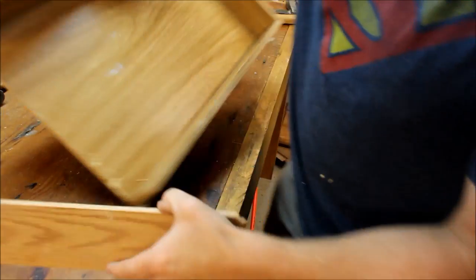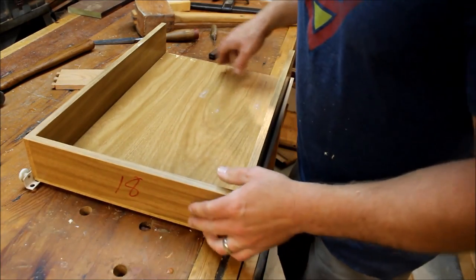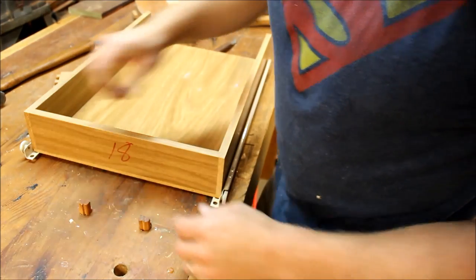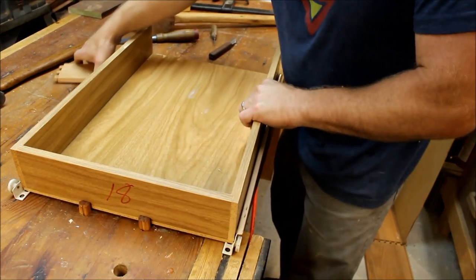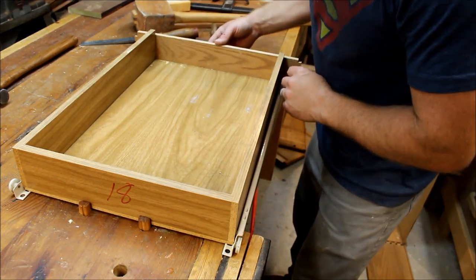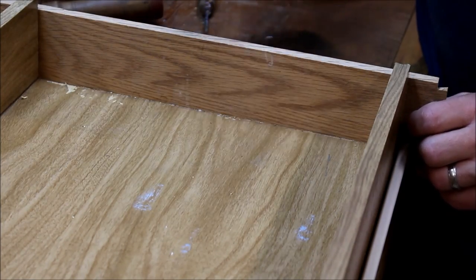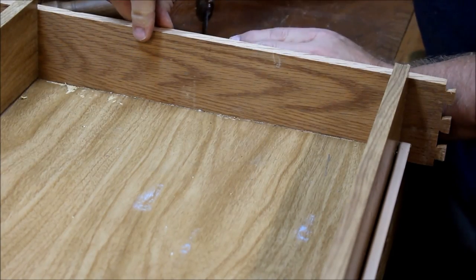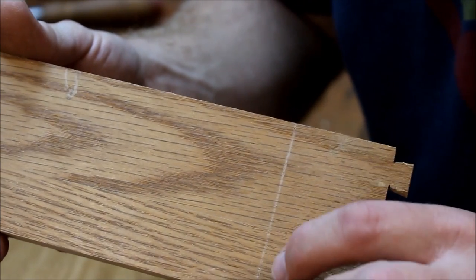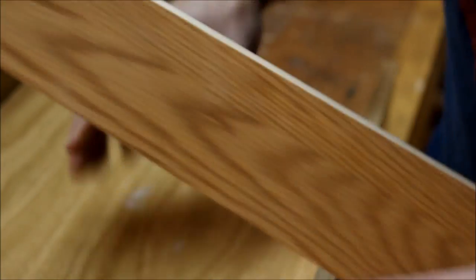To ensure I have a really tight fit, I've been putting it in place and holding it there. I need something for it to rest against, so I'm using a bench dog. Now that drawer's not going to go anywhere. I can apply some pressure back towards the drawer and mark with my marking knife exactly where I want it cut. This is much more accurate than if you tried to measure it. I have a nice scribed line and I can stay to the outside of that when I cut it on the bandsaw — that gives me a nice accurate cut that's going to fit nice and snug.